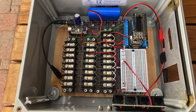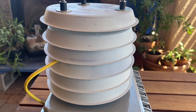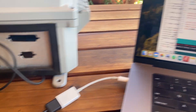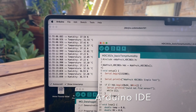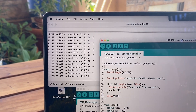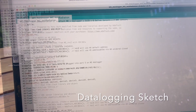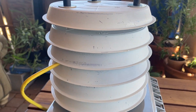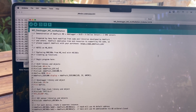The radiation shield and sensor will be one of many attachments for this new data logger, which I'll summarize in a future video. I've got the HDC302 mounted in this little makeshift radiation shield, hooked up via an ethernet cable, and I'm running the HDC302 basic temp-humidity sketch that comes with the library for the sensor — and you can see that it's working okay. Now what I need to do is come back to the sketch I put together for Mission Gardens, which right now is just talking to one of the two HDC302 sensors I have planned for the installation.